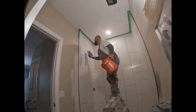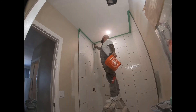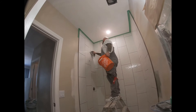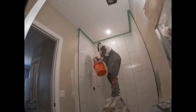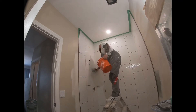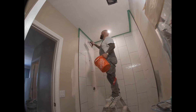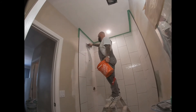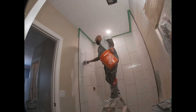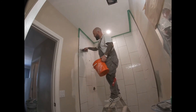I'm going to start grouting the tiles now. I've mixed the grout up in a small bucket to a nice creamy consistency. I'm using a prism grout — it's like a sanded grout but it doesn't scratch the tiles like sand does, and it has better color consistency. Since this is a white tile with white grout, it's really important to use a white adhesive. If you're going with a dark grout, use a gray adhesive; anything light, use white.